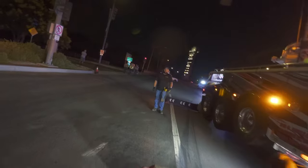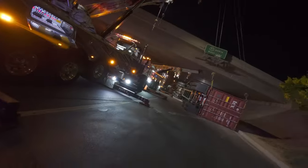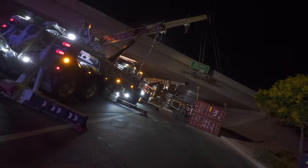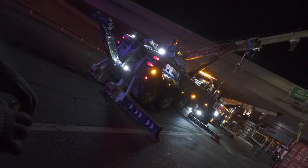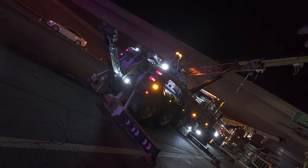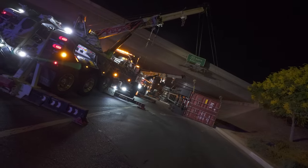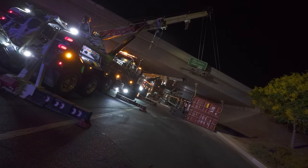I'm gonna lift off little by little. You're gonna start winching. Let's stand here so we can see the truck. All right. You want me to winch with both at the same time? Or? Little by little. Try to pull more on the blue cable. Your blue cable is the other one, so that's white and blue. Your blue one, remember, is gonna be the one on the opposite side. The white one is this one closest to that corner. Let me go up and by a little bit just to give you a little bit of release of pressure.